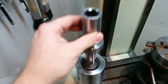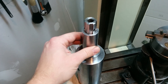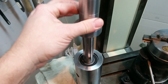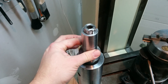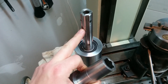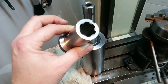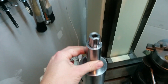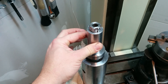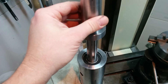It would get held up, so I was bluing the spline, running it down, giving it a wiggle, pulling it back out, and taking away the high spots. Once I turned my attention to cleaning up the flaws on the spline, things came together. Now it goes in great — you can hear just a little wiggle, a little bit of play, nothing wrong with that.